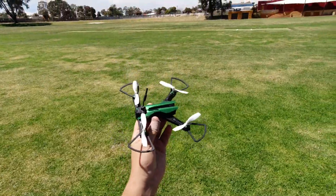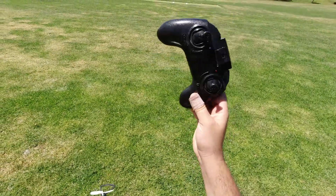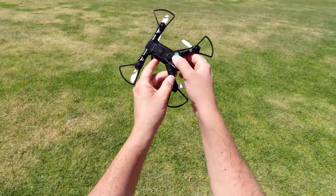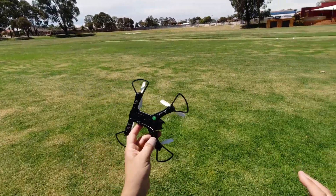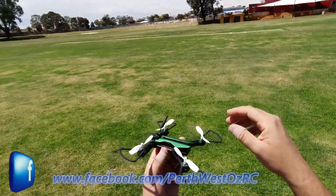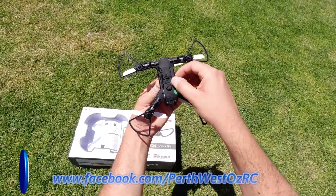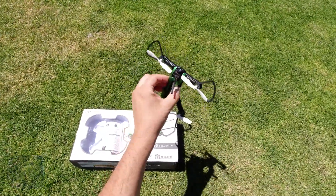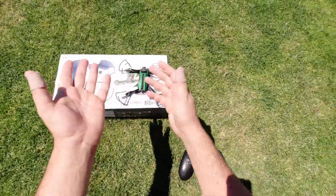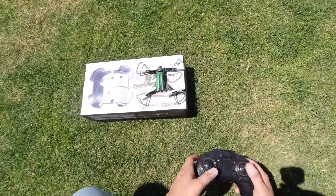This also has a low-voltage buzzer, which is awesome. When the battery goes flat you should get telemetry to the controller. There's also a beeper on the bottom, so if you do lose the quad you're able to find it — it works really well. There was one flight where it flew a bit far away and it did help me find it. To turn it on there's a little button on the bottom. The battery pulls out and uses a standard micro USB charger. Looks like it's bound — we're ready to go.